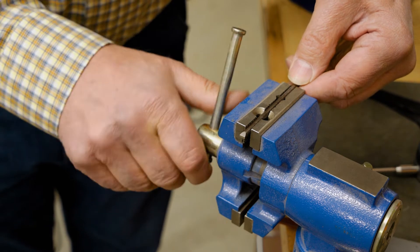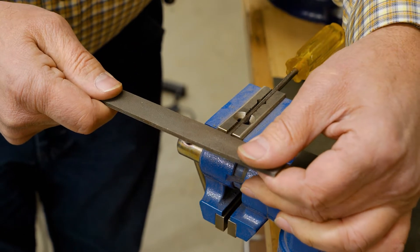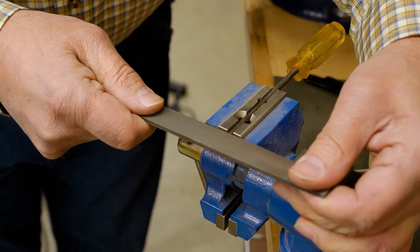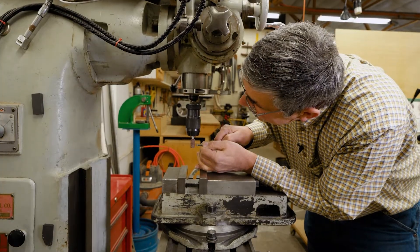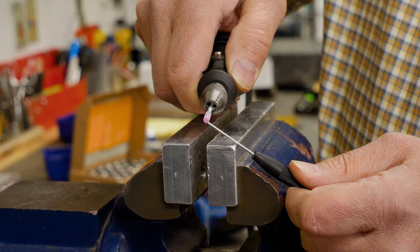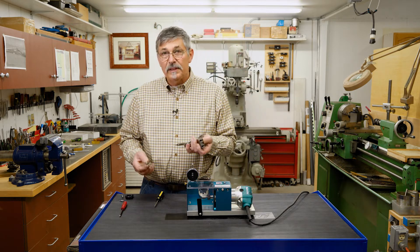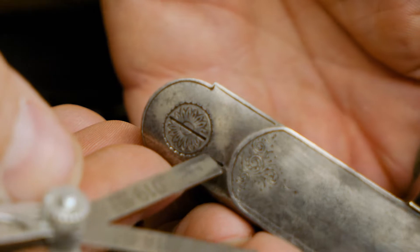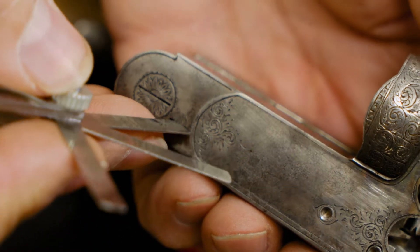At this point in time, when your choices to make a screwdriver are limited, you're going to do it by hand some way and try to hold it. The ways to make them require a great deal of skill in order to make it accurate. So let's do it a different way — let's find out how big that screw slot really and truly is. We can use a feeler gauge to come over here and test our screw slots.